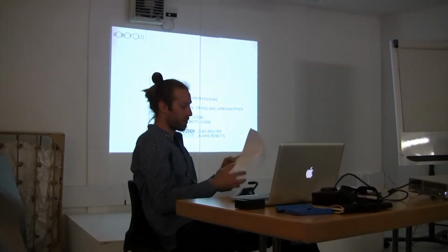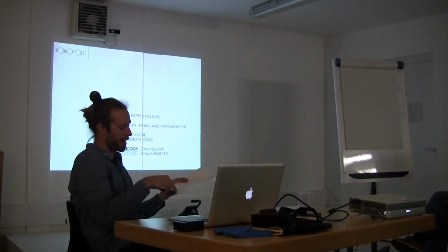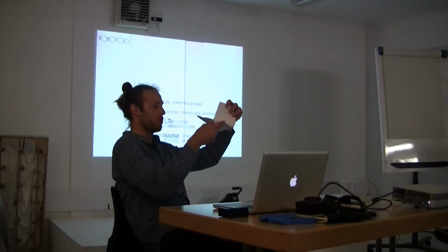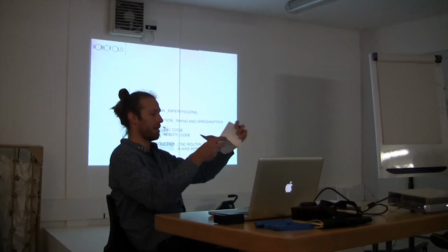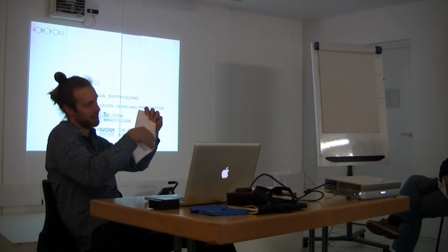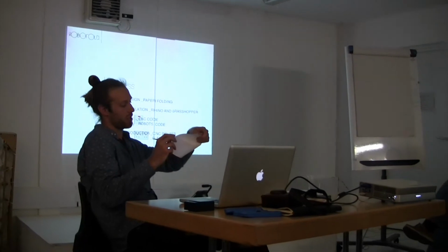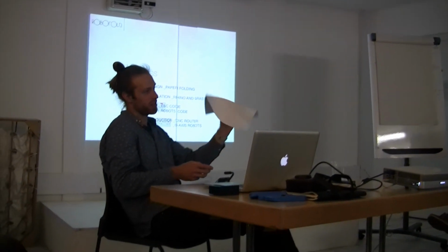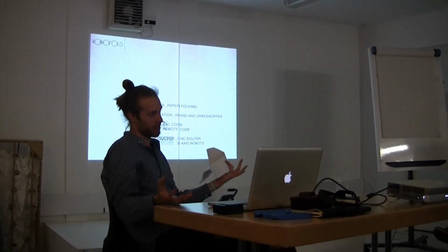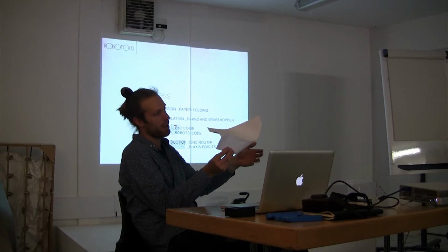Yeah. One of the reasons it works is because we don't just give it a flat sheet and a line in our simulation. We actually describe the surface. So this surface could exist like this, but I could also twist it different ways. So for that same fold, I could have a different number of configurations. If we assume this angle stays the same in the middle here, it could be quite different. So in our simulation, we try and take that information from its resting state, the equilibrium where it's in a format that it wants to be in. So the metal will have a similar end state. We could say fold it like that, but it'll just go like that when we let go. So we don't bother trying to.